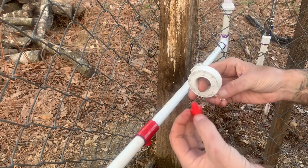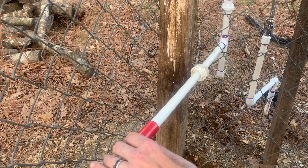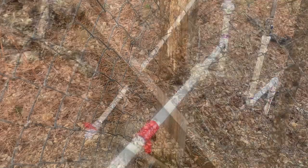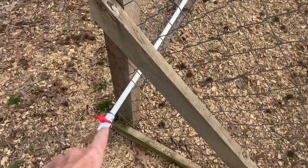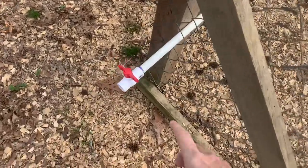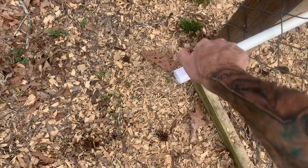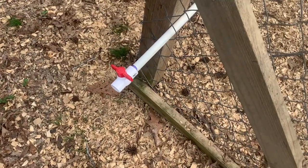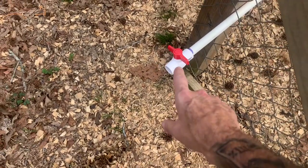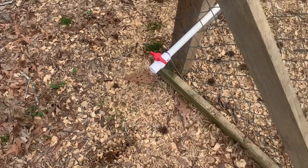Everything is level. I'm using these little nipples and I'm going to put a little Teflon tape on the threads. That's hand tight and it went all the way up. Now at the end of your run, this is where our last half-inch valve comes into play. We use this for a couple of reasons — the main one is I can flush this line out. I've already flushed this line out several times before we let the chickens out here to start drinking. Also, this can be used in the future if I want to build another coop — I already have the line out here. So that's a big plus, being able to flush this line.